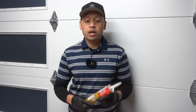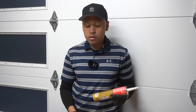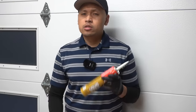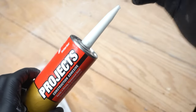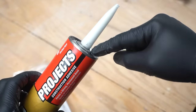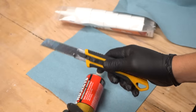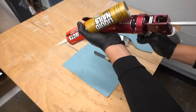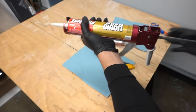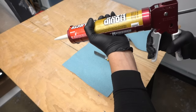Now this brings us to the third part of this video: what if you have a caulking tube you think is pretty much gone? You're going to trash it because no matter how hard you squeeze on the caulking gun, nothing is coming out. Is this thing still saveable? Let's find out. I want to introduce you to this product called Tubanu. You're supposed to cut the dried nozzle off, because technically when these little tubes dry, it only dries up to the nozzle area. I'm going to use my utility knife — be very careful when using a knife, wear cut-resistant gloves.